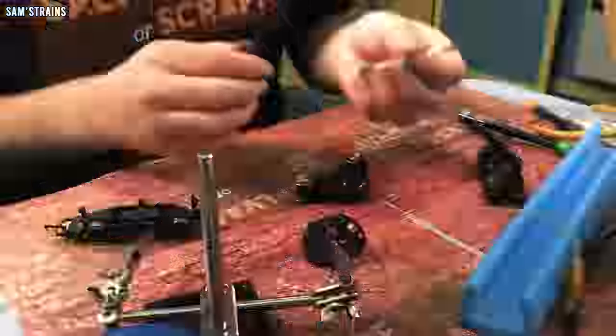Right, so I'll tell you what, let's put a little bit of oil on these shafts just so that we've got the smallest friction possible. Right, those go on. Let's put a little bit of lubricant on those gears, just using silicone grease. Okay, and then the secondary gears. Okay, that'll do, not too much on that. And then the once filthy gear holding piece can go back into position. And these are quite fiddly to fit, but not if you're used to it, I suppose.